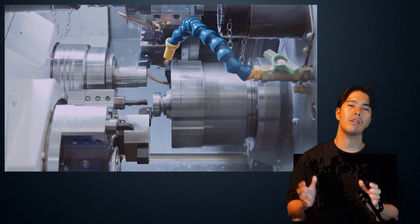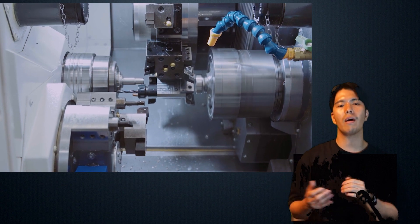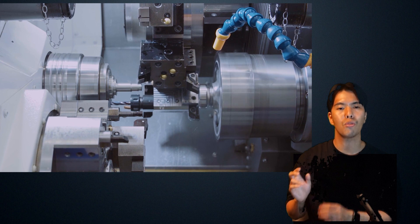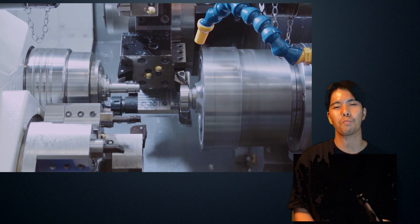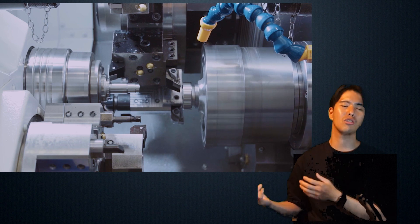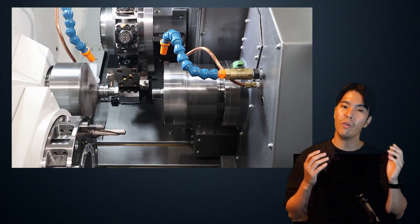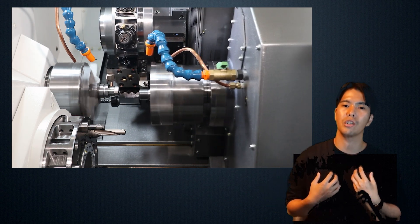Take a look at this movement of the upper turret. This is superimposed machining. The spindle on the right side follows the movement of the turret, allowing simultaneous machining on both sides. In other words, a single turret can do the machining of two-turret machines. It's a very interesting machining method. When I first saw this machining method, I wondered why it was not popular. When I asked many customers, they told me it was difficult to program and difficult to use. So we decided to solve this problem by using software technology, which is our specialty.